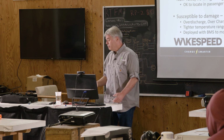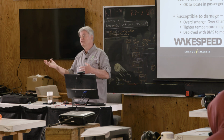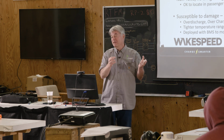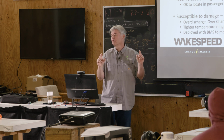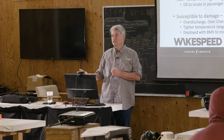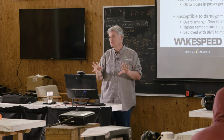It's a trade-off. Remember, I came out of the computer industry, and we manufactured laptops first with NiCad batteries and then with lithium, and we went through the chemistries. It's kind of fun to me to watch other industries discover things about this. We knew what caused batteries to catch fire, and that's why the BMSs were created, primarily for the laptop computer industry. That's where that all came from. We knew that those chemistries were more dangerous, and we worked with regulatory agencies. There are specific regulations on how you can mail those batteries. That all came about because of being careful with these types of systems and designs, right?